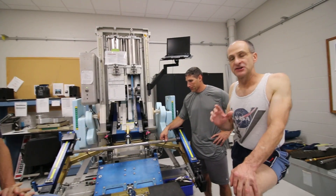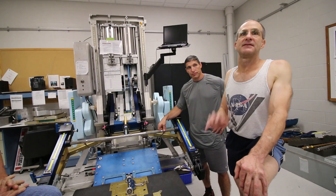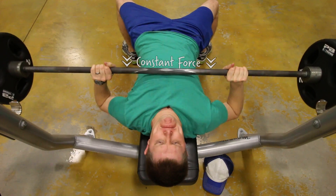It takes some special engineering thinking to make a machine that allows you to weight lift in a weightless environment. Before Dr. Bob explains how A-RED works, I wanted to see if I could figure this out. My first thought was to use a spring, but the more you compress a spring, the more force is required. Weight is a constant force, so that doesn't work. I thought about elastic bands, but the more you stretch them, the more force is required, so that doesn't work either. My final thought was to use an air cylinder — if you compressed it, that would work up to a point. But as the volume decreases, pressure increases, requiring more force.